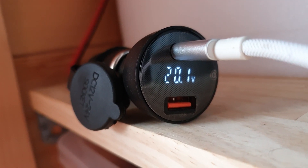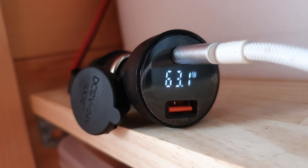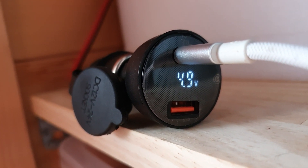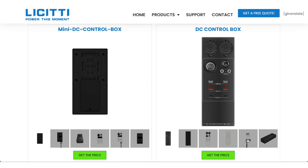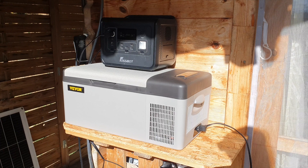You can then use the DC car plug port to run anything that uses 12 volt power — you don't need a car adapter if you don't want. You could use an XT60 plug, a barrel plug, or DC control hub boxes. For example, you can run DC LED strip lights — I use that personally, it works really well — and you've got USB ports if you use the right ones as well.